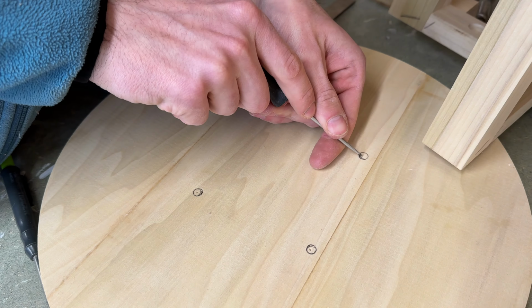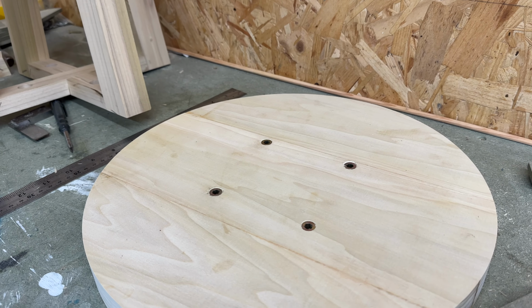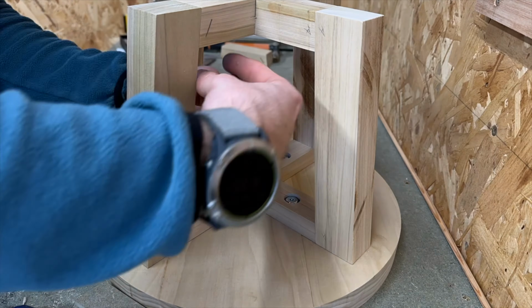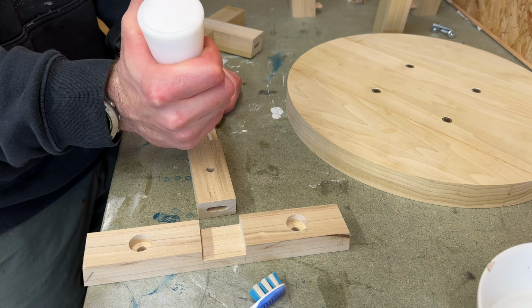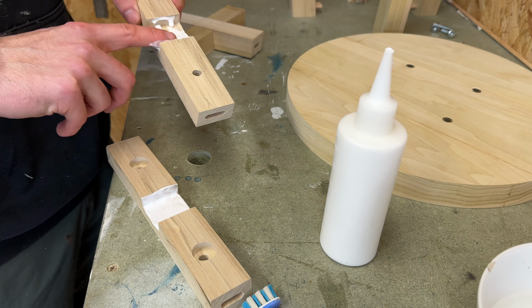I never gave any thought to whether I'd be able to drill out the holes for the threaded inserts to accept the bolts from the drill press, as I just assumed I would be able to, but I was very close to running out of room on the drill press, which would have been very annoying, as not long ago I sold my drill guide for my handheld drill, as I never actually used it. I made sure to drill the holes for the bolts and the legs oversized so that it would allow room for any wood expansion, which I doubt there would be much, but still better to be safe than sorry.